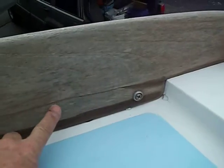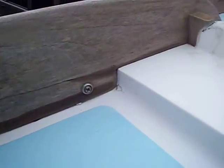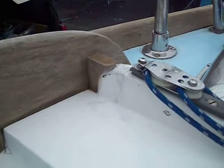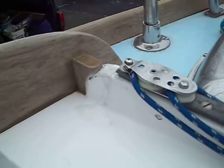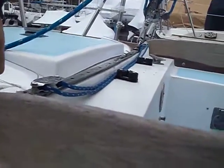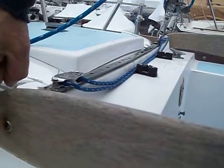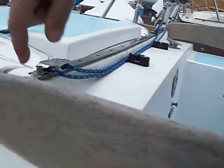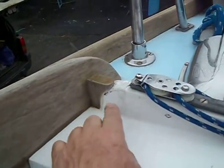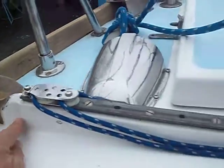Here's the crack right here that you're talking about. But the thing is, these blocks of wood here are critical. I used 5200, made some new blocks with 5200, and to reinforce it, this screw is like two and a half inches long and it goes at an angle down through that block and into this solid fiberglass here on both sides.